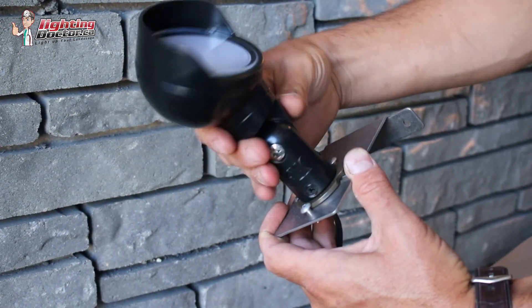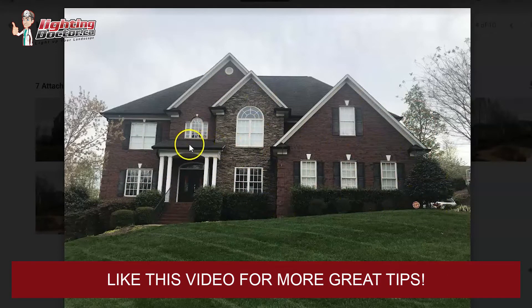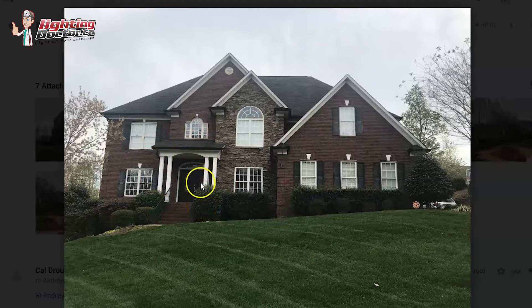In summary for the front of the house, I'd be looking at those 35-watt equivalent lamps — four on one side, four on the other, so eight total, plus one standard one up in the gutter, for nine. If there's any way to get an accent light behind the bushes to highlight those pillars in the entryway, I'd definitely do that. The light hits the top section and spreads, almost lighting the entire archway and making the home really inviting.